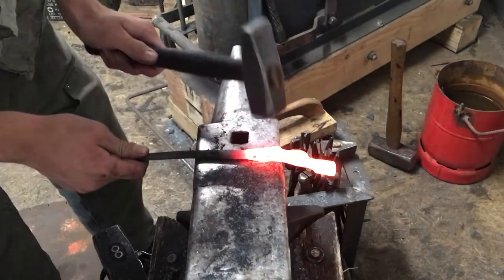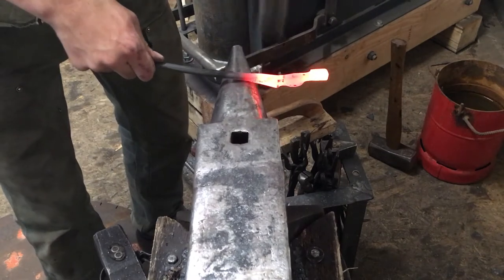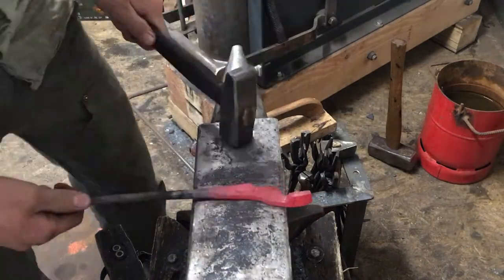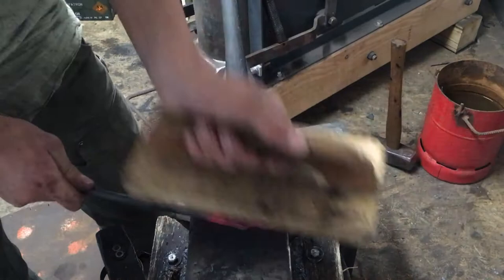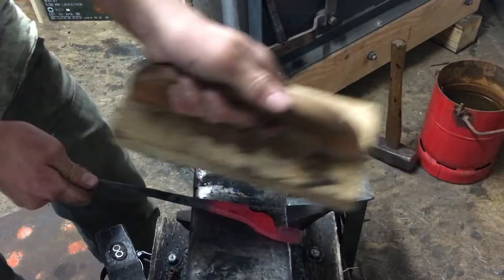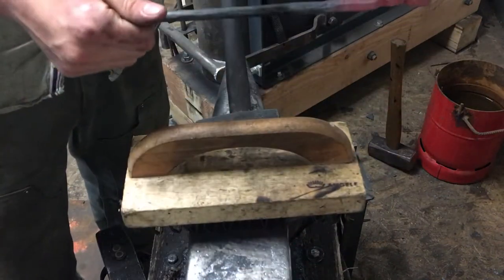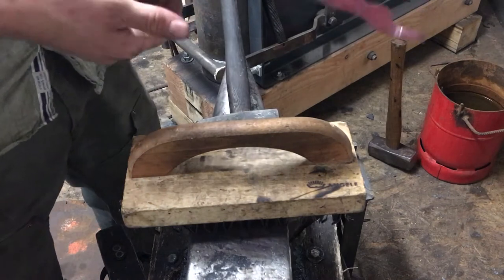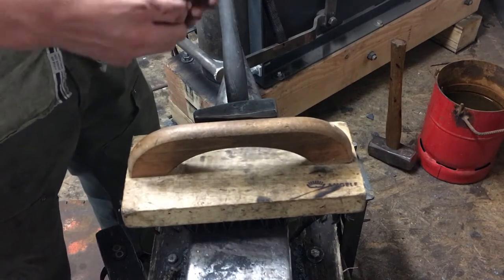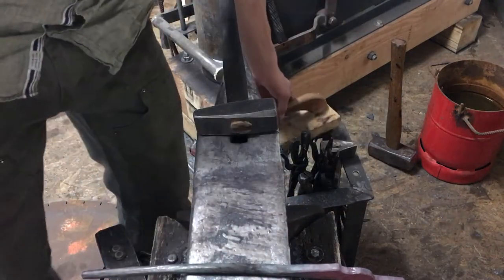So the heats I'm doing now are just some finishing heats. Get a good brush, cleaning everything up very well. And now I'm gonna put it in the fire on the opposite side, and finish to round off my jaws and my jaw beginning right here and my reins, and then brush them really well so we don't have to file them up or do any grinding to them.